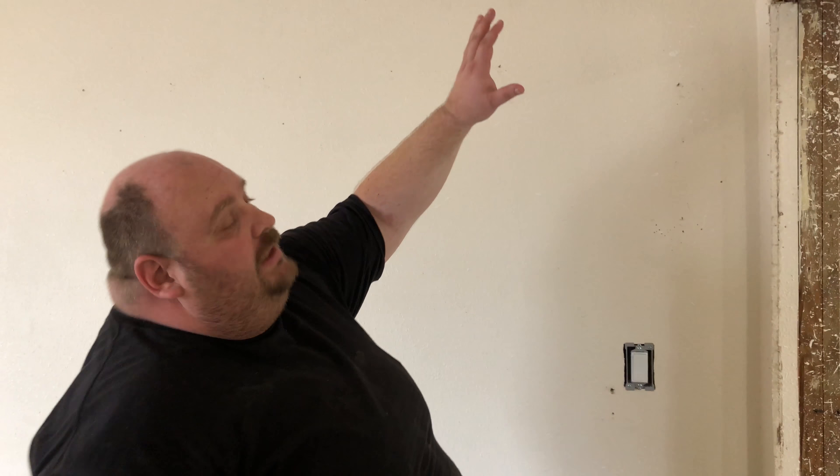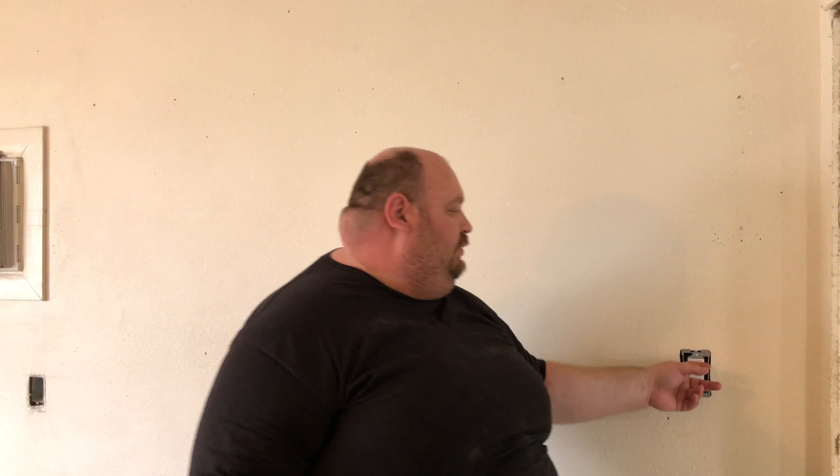First of all, we started with this. What do you got here, Jason? So what we originally had here was a wire mold box on this wall. The problem was the wire mold did not cover the wire all the way up. We can't have exposed wiring — it's a safety issue. So we went ahead and cut the wall open at the top, brought that wire down below, put in the switch for this box, and we are good to go. We are up to code, legal and safe.